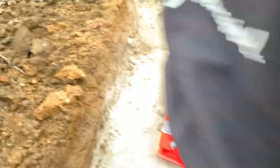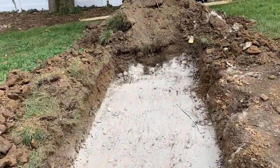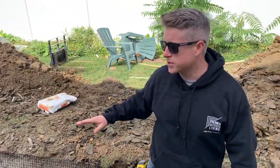We're running the compactor. We have our Type S mortar in the trench amending the soil as we speak, and we will compact this into the subgrade. Then we can start on some geogrid and some three-quarter clean stone. We now have our trench excavated nicely, soil amended and compacted, and now we have some geogrid in here. It's going to help strengthen our three-quarter clean stone and eliminate any shifting within the stone — the stone locks into the little holes and eliminates its ability to move and shift. We'll probably do two layers. Geogrid everywhere — the more geogrid the better, it's cheap insurance.